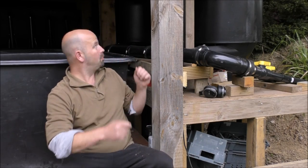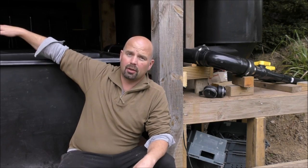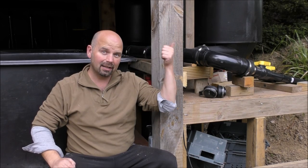Well, because this whole system, once the pump actually pumps into it, is going to flow via gravity through all the different containers and then ultimately back out to the pond — therefore they need to be the highest point. I did also get asked why I'm not making this a gravity system. That's because I've got nowhere level with or slightly below the pond to install a gravity system, so it has to be pump fed.